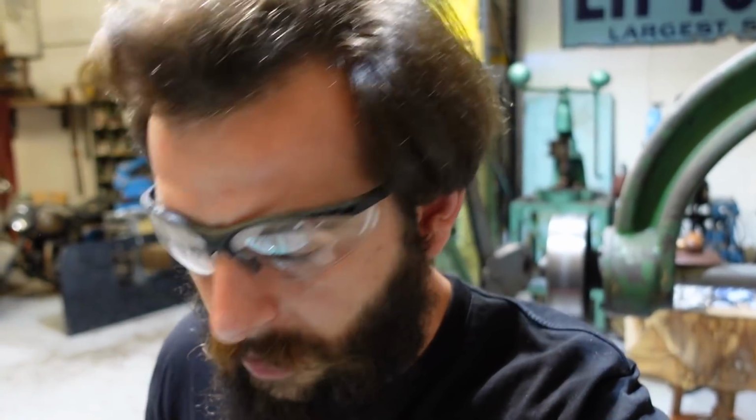Oh God. Oh great, my camera is now completely covered in aluminium dust. This is going to take a while. You know the process. I'm going to nibble around the edge with my angle grinder, and then I'll come in at the end and file it with some files just by hand, just to tidy it all up. This will be the next hour or so of my life.